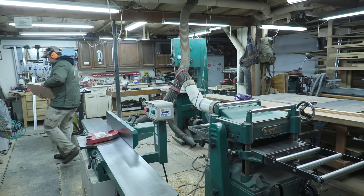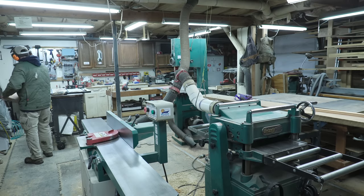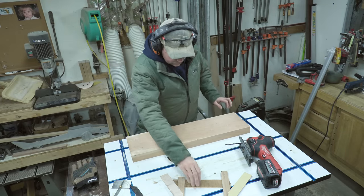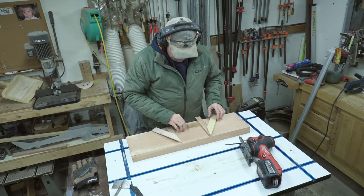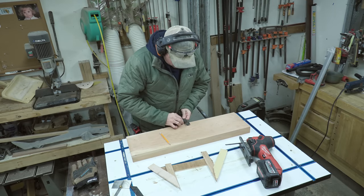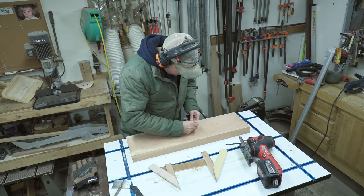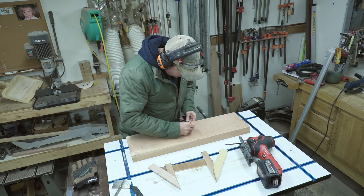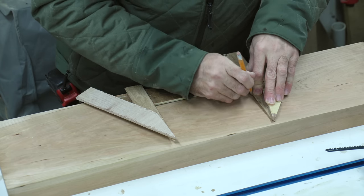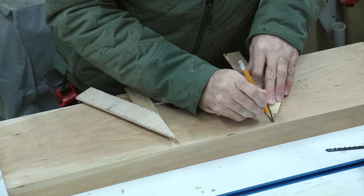With all the decking pieces cut to shape, it was time to move on to the construction of what can be considered a breast hook. And while this is not necessarily a true breast hook in the construction terms, it's more of a nailer for a place for the decking to land at the bow. Additional structure will come later in the form of some bulkheads, but we'll get into that later. However, this piece does need to fit correctly so that it ensures the proper bevel and angle for the decking as it lands at the bow.